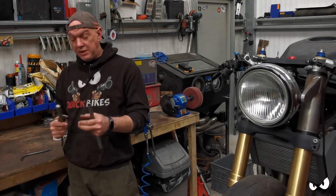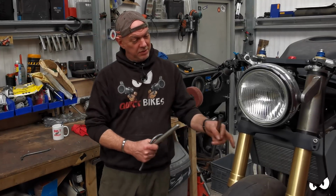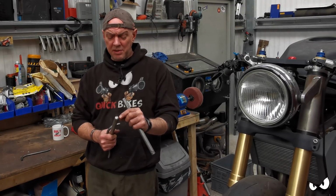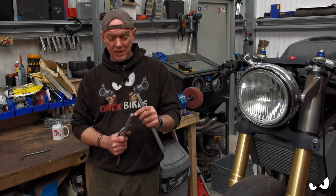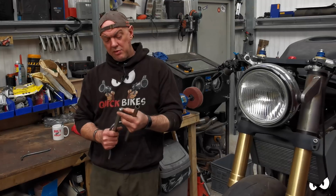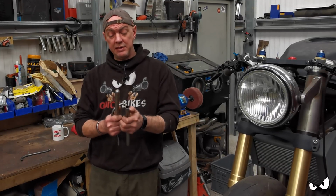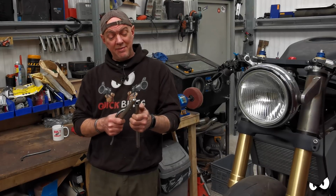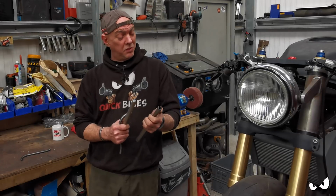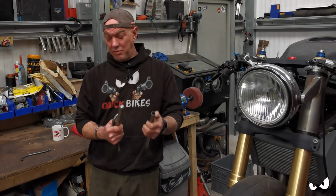And then with this, I just need to machine up a couple of bungs, which I can plug weld on the underside of this, which then goes into a thread. So the shoulder ain't got to be very deep at all. It's just enough to spread the load a little bit, because that's just sheet steel. So spread the load a little bit there, plug weld it from the top, and then we'll just have a thread, and that will go through here. And we can have rubbers top and bottom, little bit of thread sticking out the bottom, stick a washer on it and a dome head, and that's it, job sorted. And it will look quite good.